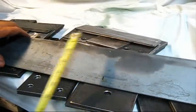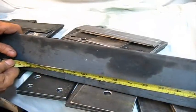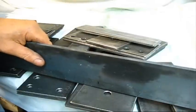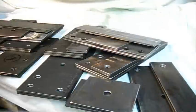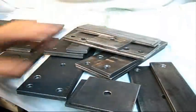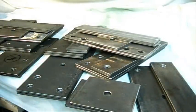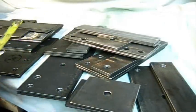The main cross pieces are 4 inches wide, 1/4 inch thick, by however wide you want the cart to be. This cart that I'm building today is for a small and maybe even a medium size engine, up to like a 2 horsepower. The ones I am building today are for a McCormick Deering 1.5 horsepower and a dish pan 1.5 horsepower and a 2 horsepower, a little Nelson cart, Nelson Brothers.